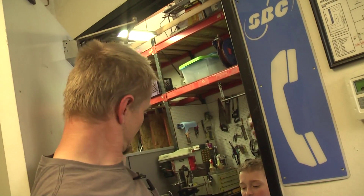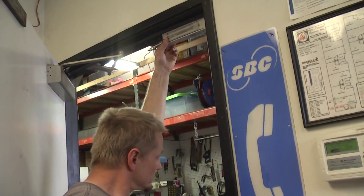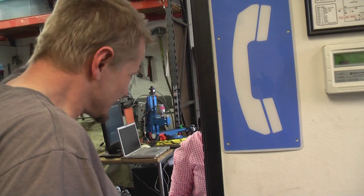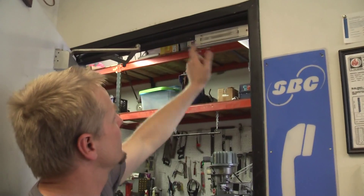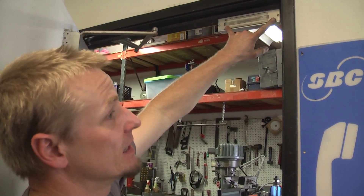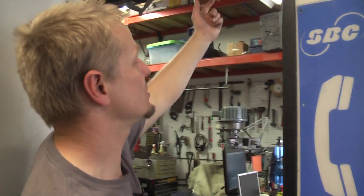Once we get inside, we have another kind of lock on the inside door. This is a magnetic lock - a 2,000-pound electromagnet - and we can set this to be locked or unlocked. This is an example of a fail safe: when you interrupt power to this electromagnet, you can no longer keep the door locked. We actually have a battery that gives about 48 hours of backup to keep these locks. You typically need something like a motion detector, a button, or both - we have both to always allow people an exit path.